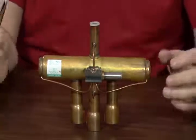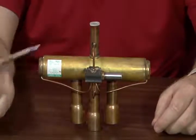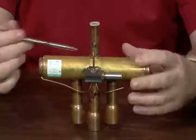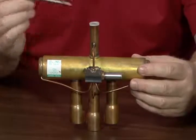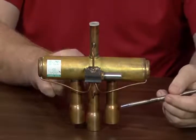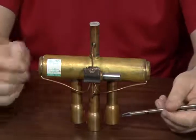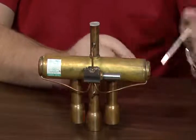So as an example, if we had discharge from the compressor here on the top side line and the slide were moved to, let's say, one side of the valve body, then discharge from the compressor will travel through this line. It will bypass the interior line and the outer line and then head to the indoor coil, so it's acting as the condenser.